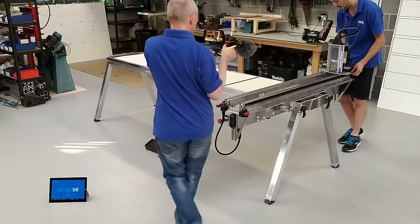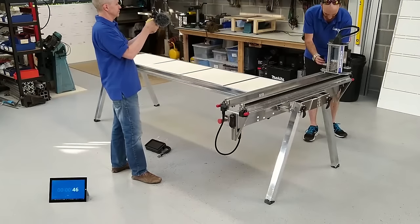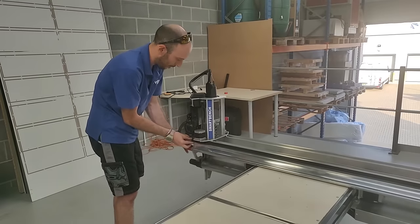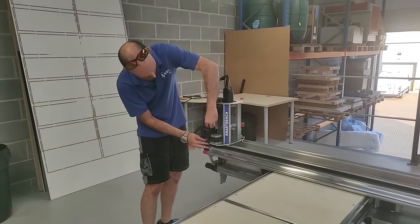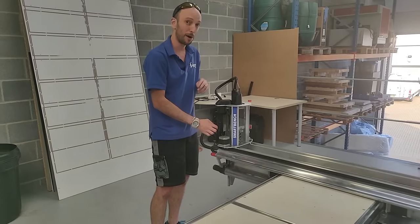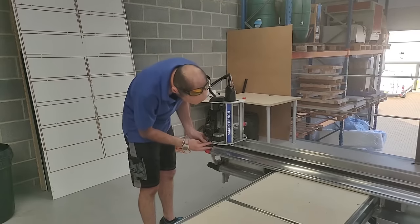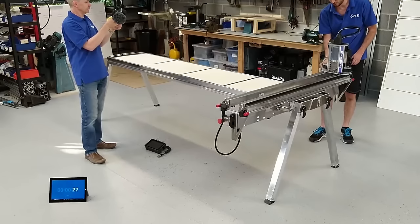Last piece: the next one is going to be a power loom, which obviously gives it the juice. We keep those separate, by the way, because it's good practice from an electronics perspective to keep the power away from the signal. And it's two looms — we're going to lock that in place with the thumb screws.